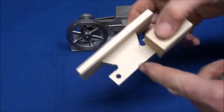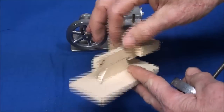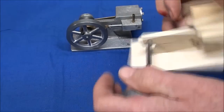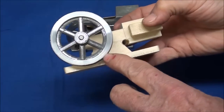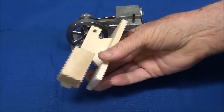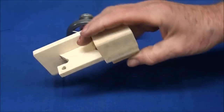Similarly, when I made this one, it was just made up with basswood or aspen — whatever is soft and easy to work with at the right thickness. I like to buy some of that hobby wood in various thicknesses when I do something like this. There it is cut out; it's been glued together in spots. I even put a hole in there for the flywheel. I must have made more than one of these and thrown them away, but here's another one where the flywheel is going to interfere with the base, so I changed the height of that slightly.